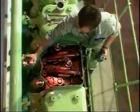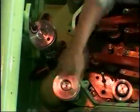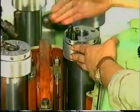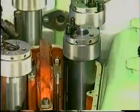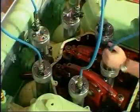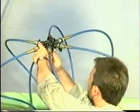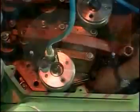Mount the hydraulic jacks and screw them firmly against the spacers. Make sure that the parts engage correctly. Unscrew the jacks 3/4 to 1 revolution to provide for the contraction of the studs. Connect the snap-on couplings to the distributor and to the jacks, and connect the high pressure pump to the distributor. Vent the system if necessary and increase the oil pressure to the prescribed value.